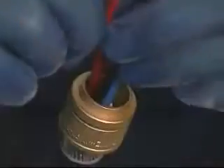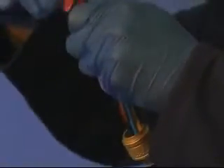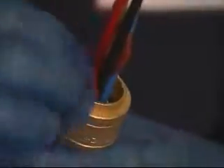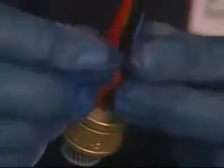Mix the compound found in the two plastic bags until they blend together into one solid color with no streaks. Once mixed, apply to the conductors within 30 minutes, as after this time the compound will begin to stiffen as the curing process begins. Spread the cable conductors apart to enable the compound to be packed into the crotch of the cores. Close the conductors together and bind the ends with tape. Apply compound around and in between the cable conductors extending no more than 35mm up the cable. Ensure all voids and gaps are filled.